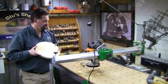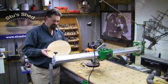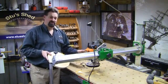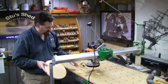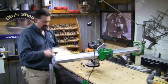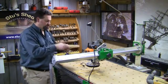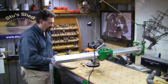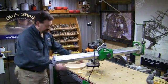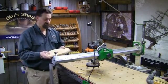That's how easy it is to actually cut a circle. A few pick-up points that would have been quite obvious: firstly, my dust extractor actually clogged part way through the cut, so I was getting a lot more shavings than I was expecting. Secondly, this board had a bit of a cup in it which was causing me a little bit of issue. And finally, I had to adjust the height of the dust extraction guard. But other than that, that's how easy it is to cut a circle on the Torque WorkCenter.